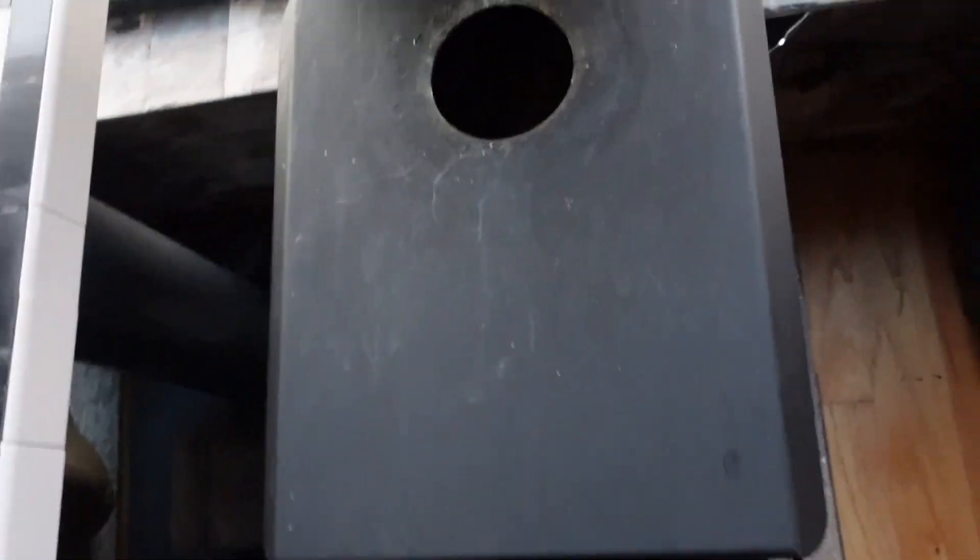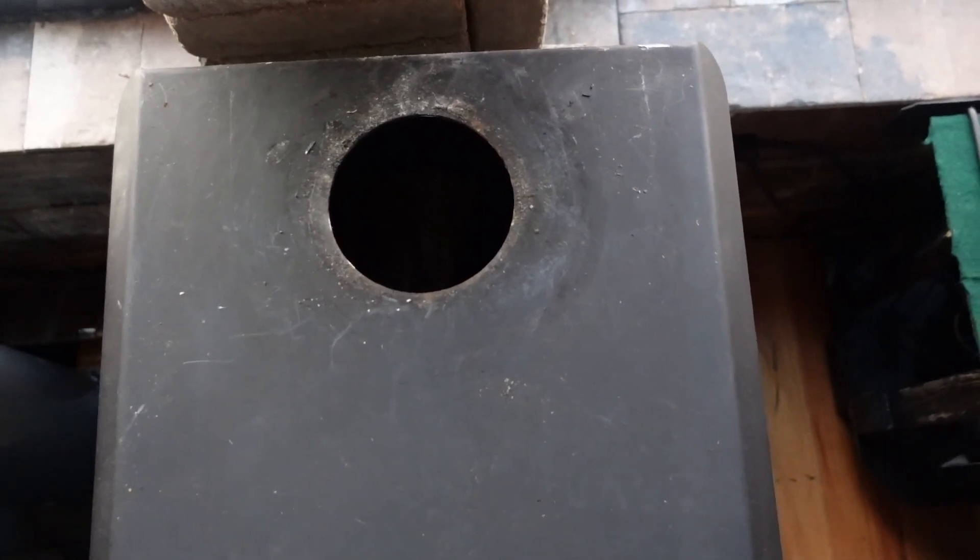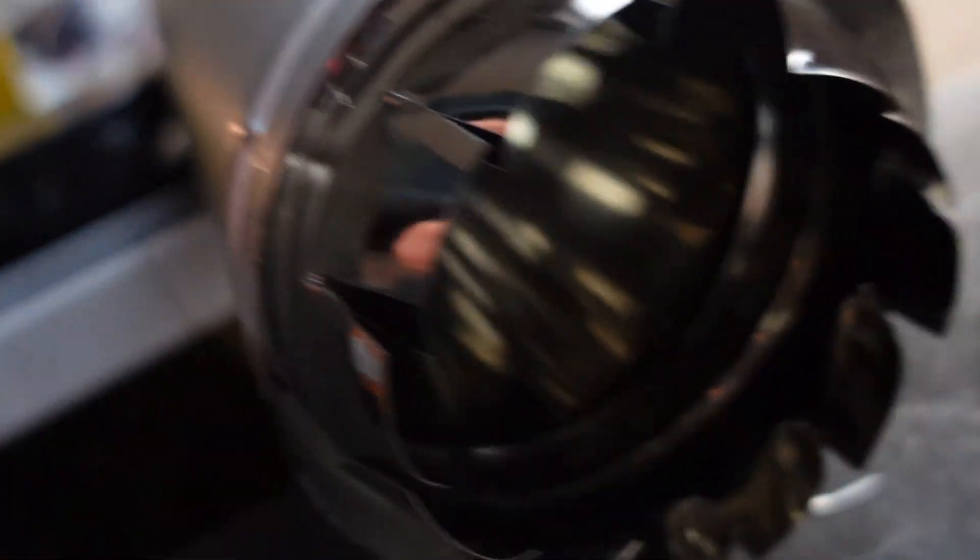This double pipe has an outer and inner layer, and the inner ring is too small for the hole in the stove. You've got a choice: you can cut that hole — which is going to tear up about anything — or grind it out. What I decided to do was make relief cuts around here, and then I'll be able to pack that stuff in and around. This stuff is very sharp, but now you'll see it just kind of goes right in there pretty tight. With the packing and the exterior pipe covering it, that's pretty good.